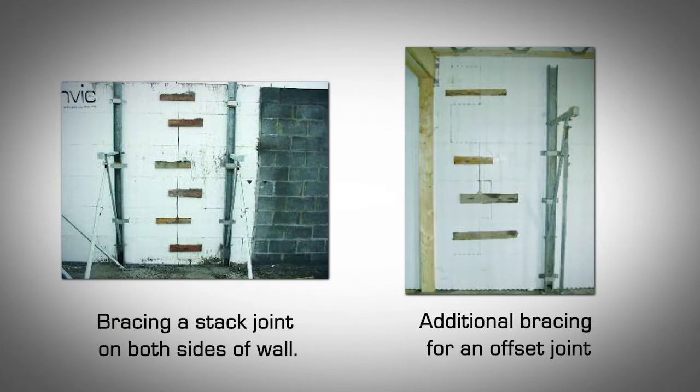Additional bracing. Additional bracing may be needed to connect or bridge at least 2 intact webs or a web and a buck. You can make this added bracing cleat with strips of OSB, square patches, dimension lumber, or concrete stakes. Additional cleats or bracing are required for any, but are not limited to, the following situations.